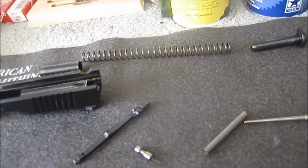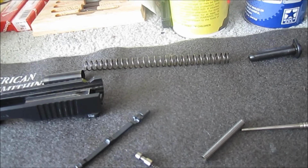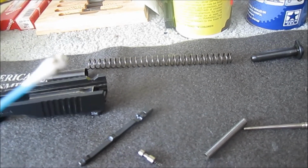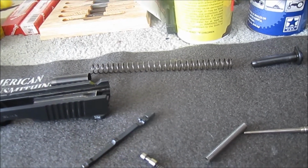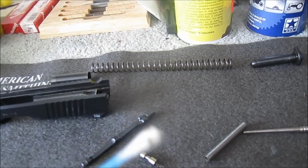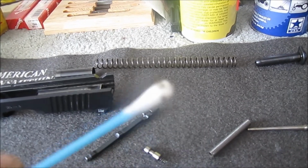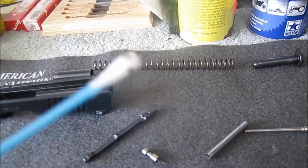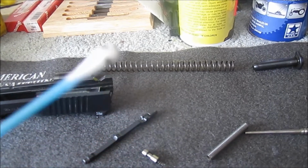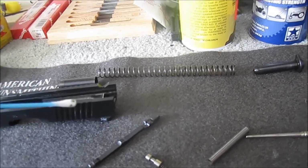So if your firing pin channel is full of gunk, whenever the round feeds up, it's feeding up at an angle, and the firing pin hole, if it's not chamfered, which Beretta is the only manufacturer that does that, so unless you took it to a gunsmith to have it done, only Beretta does it. So usually they're pretty sharp. As it feeds up, it chips off a sliver of brass. Well, that brass can go in there, or it can fall down in the gun, who knows.